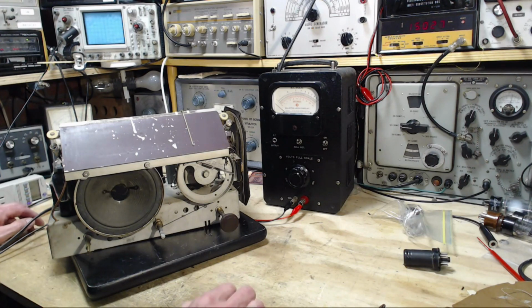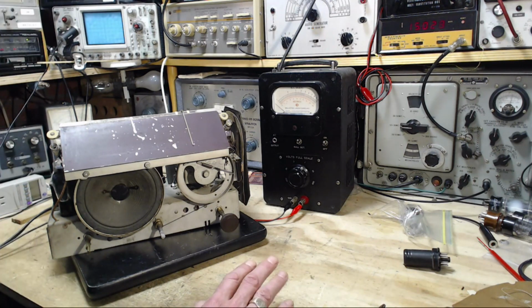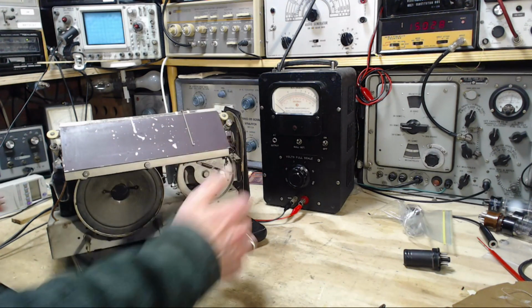And I'm going to leave that alone, move on now to the shortwave bands, the 3 shortwave bands. That amounts to doing 3 local oscillators, or 3 oscillator adjustments, and only 1 RF adjustment in the process. So it's really about getting the pointer into the right spot.